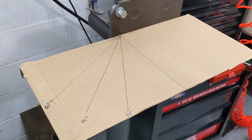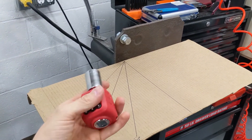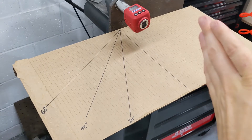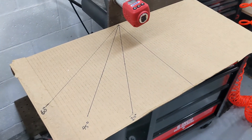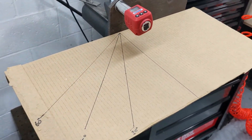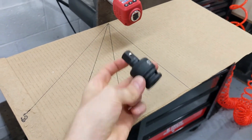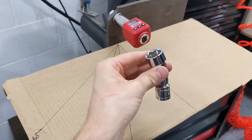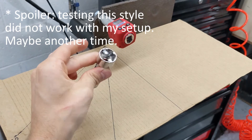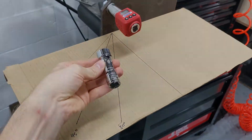So we're going to test this out. I've got an AC Delco half-inch torquemeter, and we're going to use a torque wrench and try this at various angles using a half-inch universal adapter. We're going to test this style, and we're also going to test this style to see if there's any difference. Then I'd like to test this style too — the flex head socket — to see if that makes any difference. I don't have a half-inch one of these, so we're going to have to modify our testing procedure.